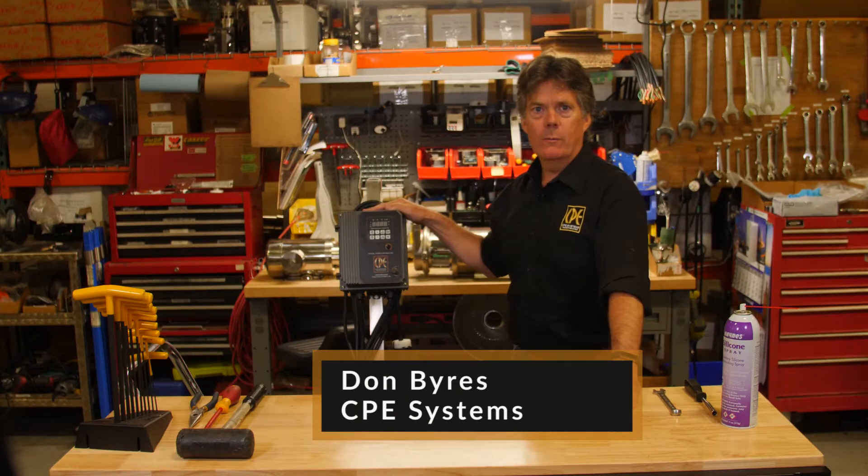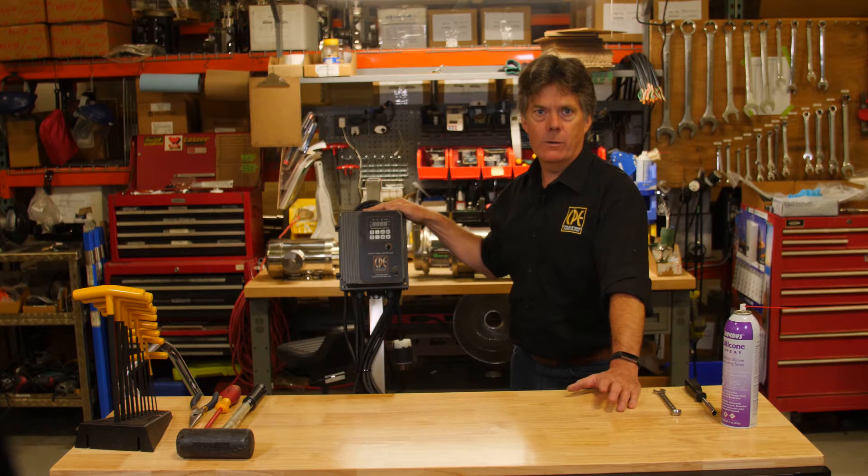In this video, I'm going to show you how to program the controller on our pump so that the variable frequency drive, otherwise known as a VFD, will work with a GFCI ground fault plug. The feedback from the VFD causes the GFCI plug or breaker to trip in your panel. We have a setting to ensure that this doesn't happen, and I'm going to show you how to program that into the controller.